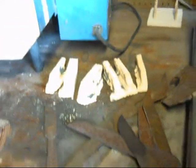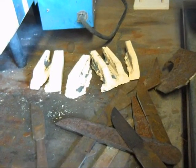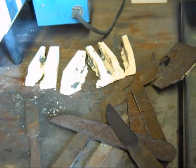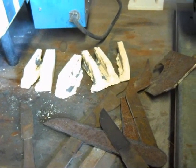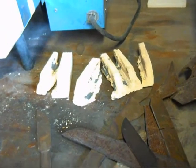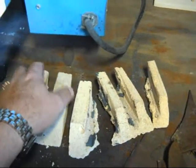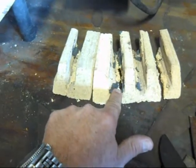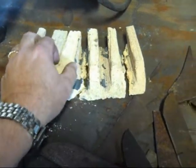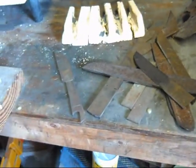When I started doing that, you get some that drips off the blade as you're putting it on. Because when you put it on the hot steel, as I showed in the previous video, it just melts to it almost like a glass-looking substance. But I found, as you can see here, these pieces — this used to be my knife holder — and I'm not sure if it was caused by the non-scaling compound dripping on it, but it was pretty much destroyed when I went to do heat treating another batch of knives.